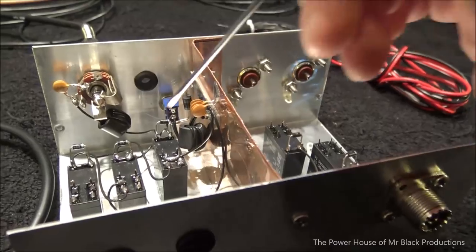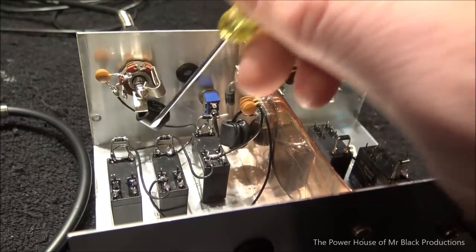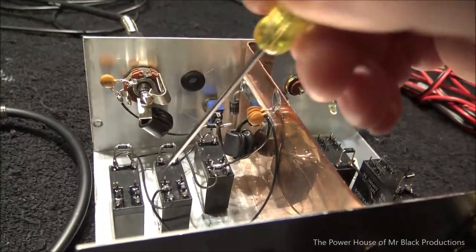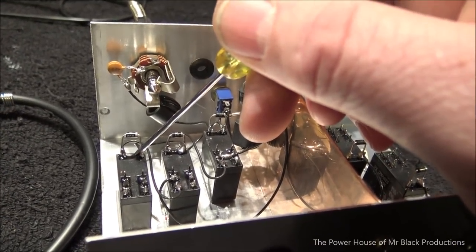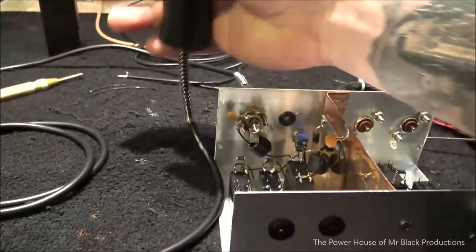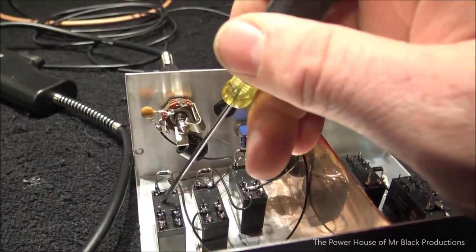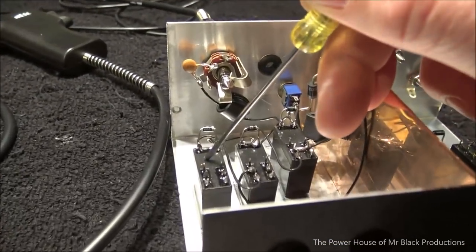We'll come back over here in a second. So this relay closes, takes a 12 volt source, runs it around in a loop, comes back over here and trips this relay. This relay in turn has its own 12 volt source. Once again, we don't want to create a loop that gets tripped and closed to here, which in turn fires this relay. Now the physical work is done here. So pull the trigger, click, this relay closes. About 10 milliseconds later, this relay will close. This one will fire the Icom. This one will in turn fire the 955, Cobra 25, or whatever other transmitter he wants to use.